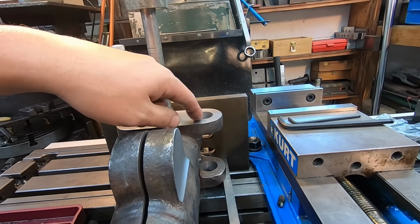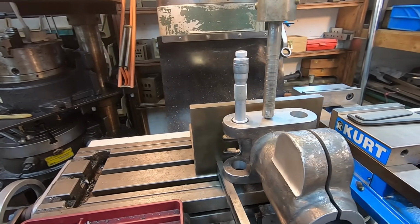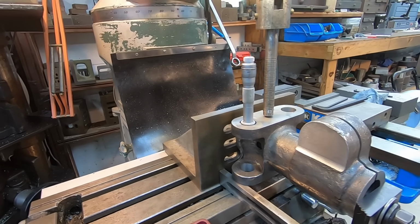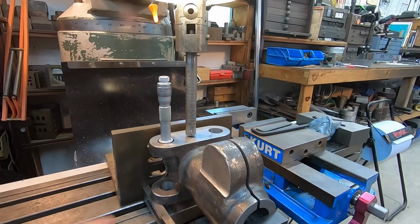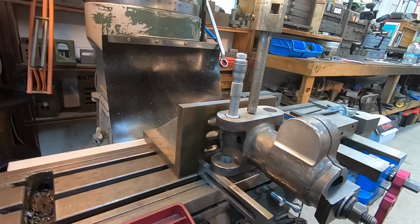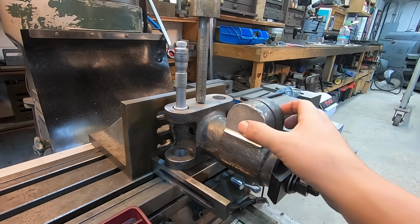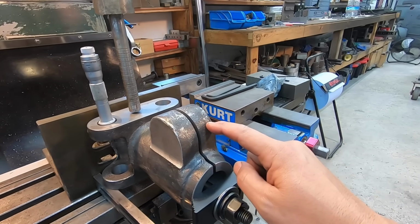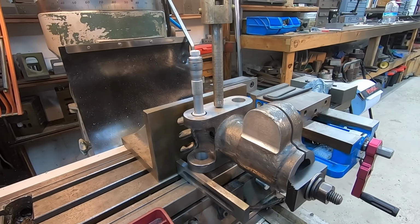That one will have to do a little bit of flapping and try to get that last dowel out of there. So other than our chamfers that we've got to work on, the boring here is complete, and we can go on to our next setup. This is going to be our last feature, which will be a drilled counterbore. The other side's drilled and tapped for the bolt.